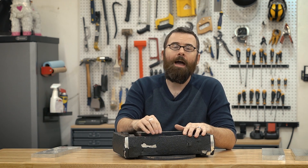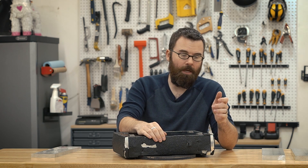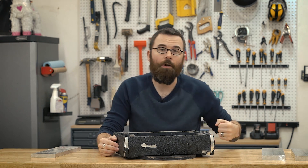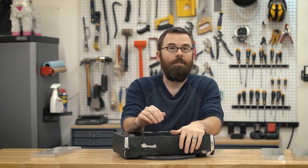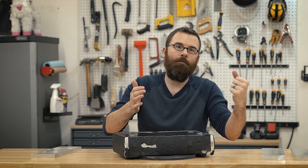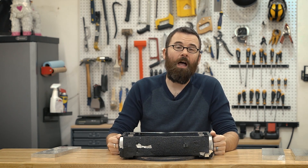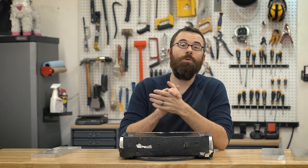It really doesn't add that much to the weight, and it didn't add anything to the cost for me. There are a couple places where you can see that weapons just kind of bounced off of it — maybe if the Line-X wasn't there, it would have impacted into the aluminum more. I do like having the texture here; it does add another layer for something to bounce off of or scrape against. For the next iteration of Crippling Depression, I will keep the Line-X. I want to get a better surface finish so it adheres better — maybe even use a rougher on all the outside surfaces.